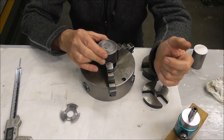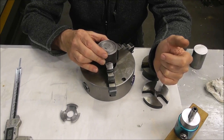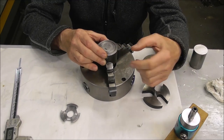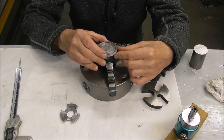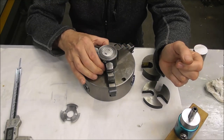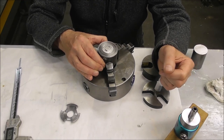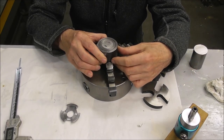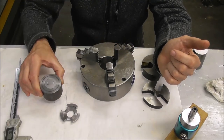Under heavy machining and parting and rough drilling, the chatter and vibration and just general machine vibration can cause the part to work its way further down into the jaw. It can cause it to fret and rattle around within the jaw, and it even can cause the part to suddenly move off center and cause an almighty crash.